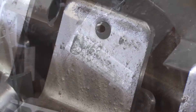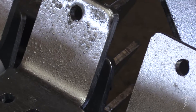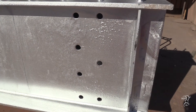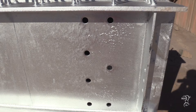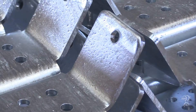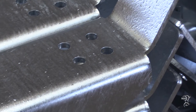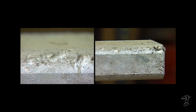Dross, zinc iron alloy particles, is a natural byproduct of the galvanizing process that may be suspended in the galvanizing bath. Dross particles can be carried out with steel and become embedded in the galvanized coating. If the dross particles are small, not dangerous to handle, and fully covered by zinc, they are acceptable. However, large or gross dross inclusions reveal a bare area beneath and must be remedied.